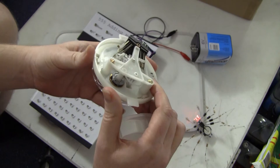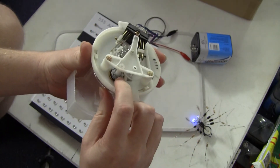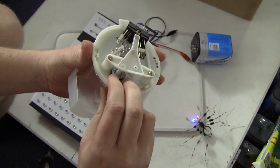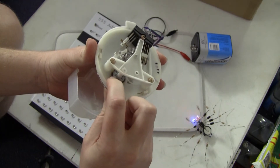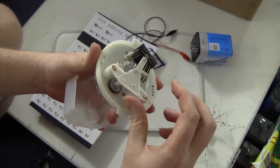Probably the part that always used to fascinate me as a kid is this governing device. It's a centrifugal brake. There's two parts of the wheel that are spring-loaded. They flip out against this brass bush, and there are two little — probably Teflon — slides, though I'm not really sure what material they are. You can see it's driven at quite high speed by some gearing.